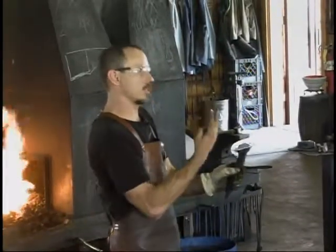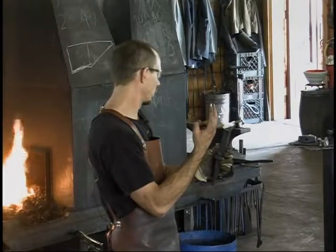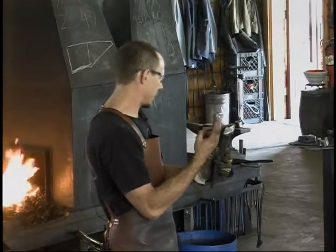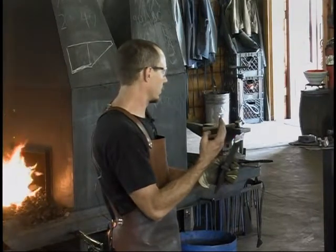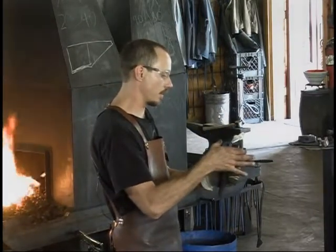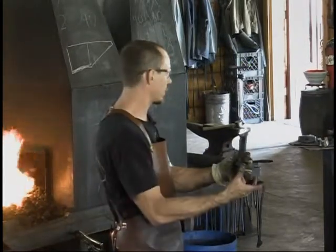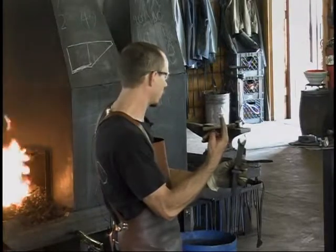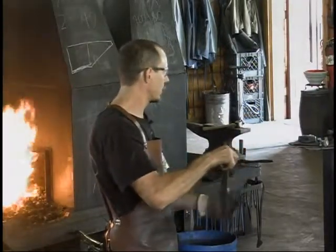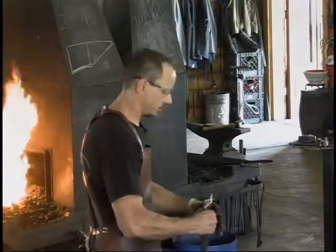I then drilled and tapped underneath for 2 half-13 bolts. Really scared myself, quenching that 4140 already tapped, but I figured that's the only way I could do it. It worked. Then I made a big, thick, heavy mild steel base to go under it, and a matching one to go underneath so it can be bolted onto a wood bench. It rests solidly on a really wide steel base. So it's the same shape on top, but just bench mount.